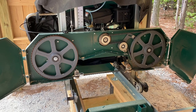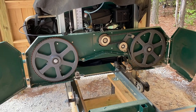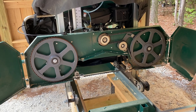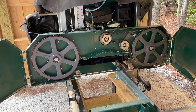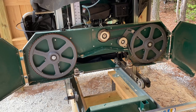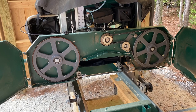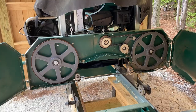One of the biggest mistakes I'm seeing is where people assume that when they take the sawmill out of the box, set it up, put the saw head on the track, they can just start the engine and immediately begin sawing. People assume this is ready to saw out of the box, and that is absolutely not the case. These mills come shipped with a blade on the wheels tightened just enough so it doesn't fall off in shipping, but by no means has that blade been tensioned or tracked properly. Mistake number one: do not assume the mill is ready to saw out of the box.